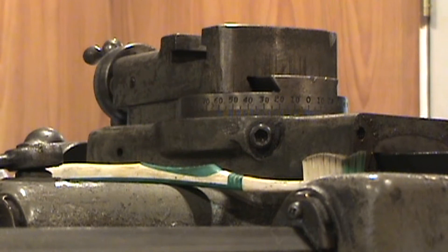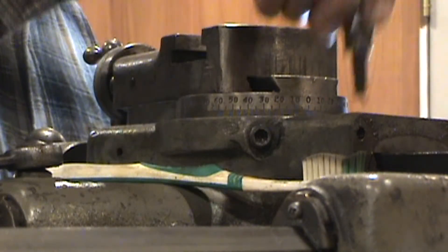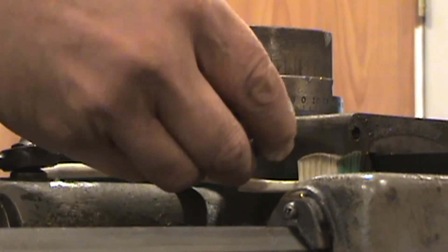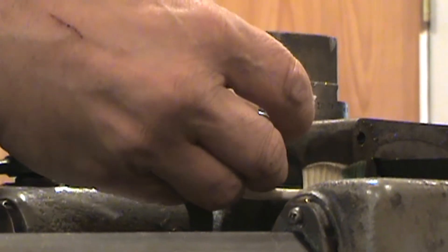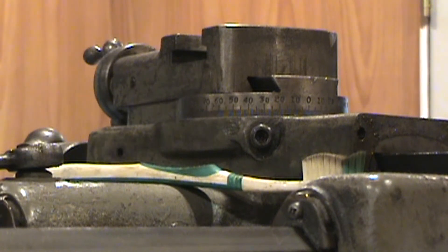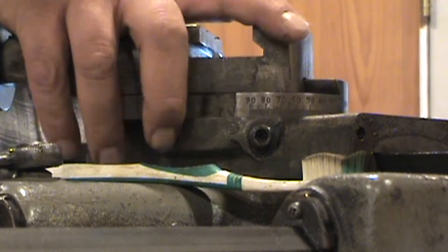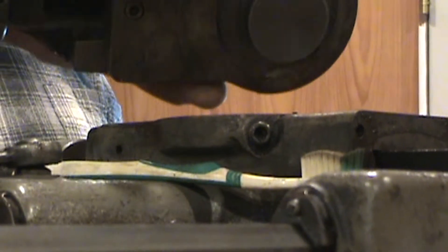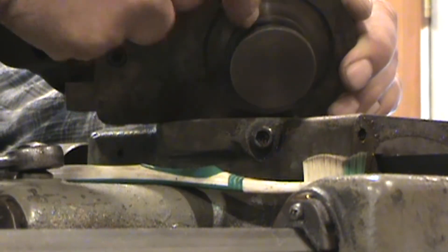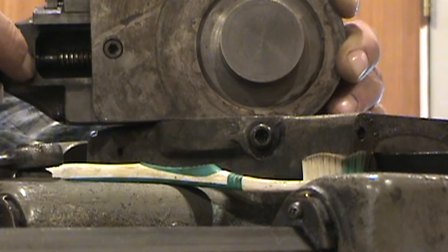There's a set screw on each side of the cross slide, and inside the set screw is a pin that's angled. You have to basically unscrew these set screws pretty far, almost to the point where they come out. This is a 7/32nd hex. After that, you can lift the compound off. You can see this is tapered and this is where those tapered pins sit in. Let's take it over to the bench and start disassembling it.